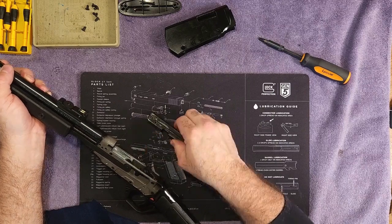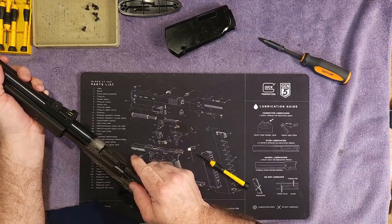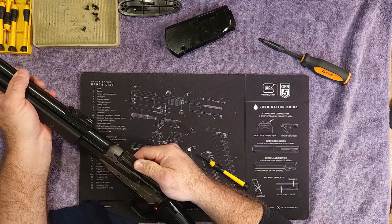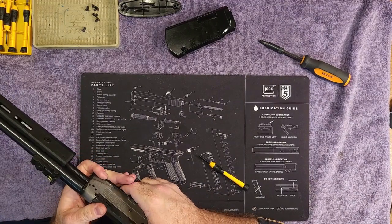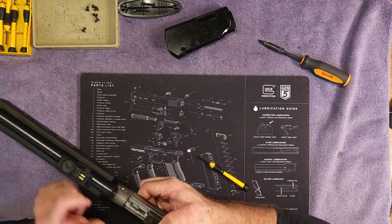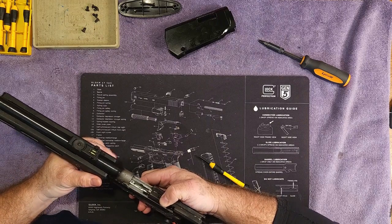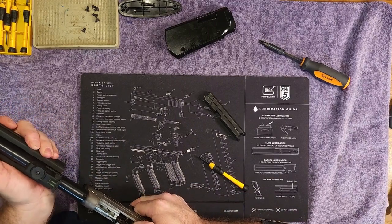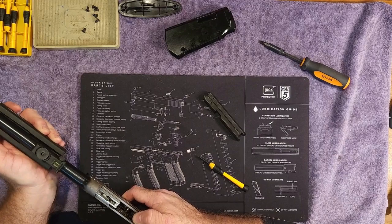So now our bolt should go right in there. Yep. So now. Oh, the bolt's still not going. There we go. That's going all the way forward. Okay. So as you cycle, pop, this comes back. That lifter lifts the cartridge to feed it. However, the cartridge is getting bound up in there. Lifter coming up and down. Okay.